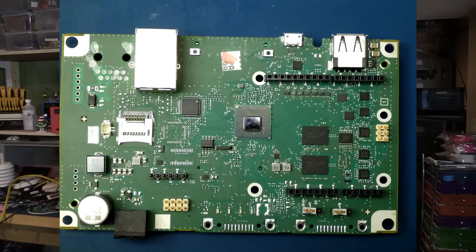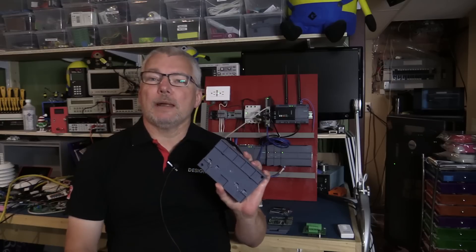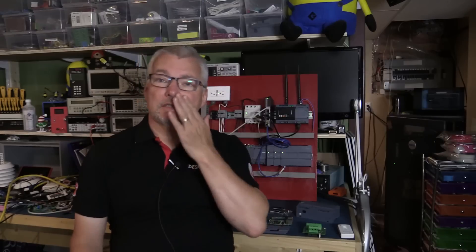The main differences are that one of them has a single ethernet and no serial ports, and the 2040 has two serial ports and two ethernets. The 2040 is aimed more directly at the industrial market and has a battery to maintain a real-time clock. The 2020 is more aimed at educational markets, does not have the battery, but you can add one if you want to, and has half a gig of RAM versus one gig of RAM. Outside of that, the two units are pretty much the same.